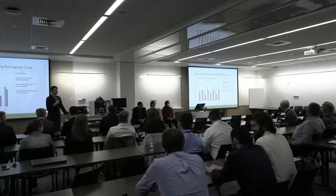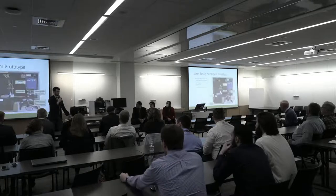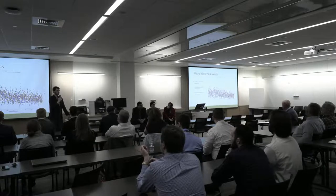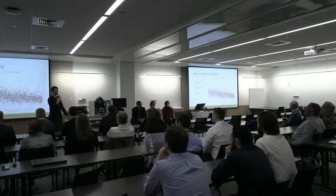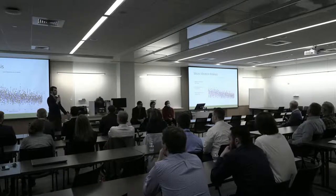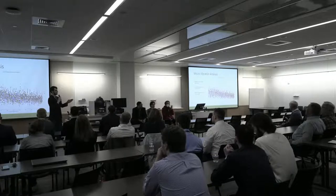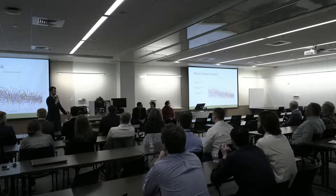Again, beautiful work. You lost me on the chart with the x-axis of vibration analysis. Can you go back to that? Sure. What exactly is being measured there? Frequency of measurement is the x-axis. It's a Fourier transform on our acceleration data that's then double integrated to be displacement. So we're measuring displacement in meters is what the scale is, but the range is 0 to 5 micrometers on the vertical axis. And so frequency of measurement is referring to the most frequent measurement being at 0 here and going down. So our peak magnitudes are in that first section there. Did that clear that up or make it worse?